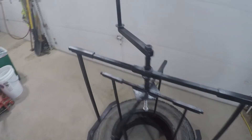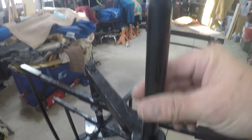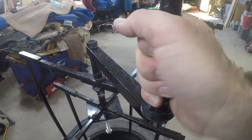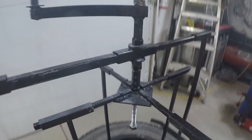Now I'll show you a couple of the changes I made. One change from his plans: he said use a round post here, but I ended up using all-thread. I put a small piece of steel pipe on the outside with a couple of washers on top and bottom just to contain it, so this actually spins in your hand as you roll it — you don't have the rod twisting in your hand. It does add a little bit of weight.